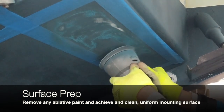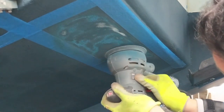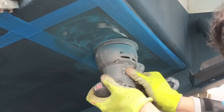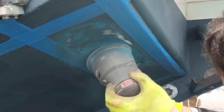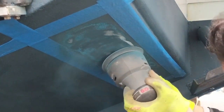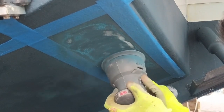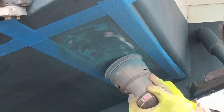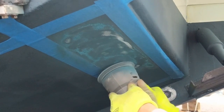We're going at this with 80 grit. Have a few different options because every bottom paint and coating is different, so have a few different sandpaper grits and types of tools available. Whether you use a random orbital sander or a grinding wheel, try not to gouge the surface — keep everything nice and flat. Deep gouges aren't the end of the world but they make the install harder.